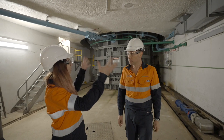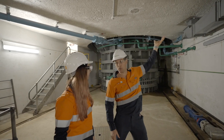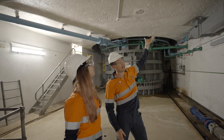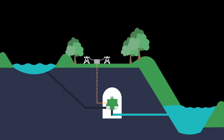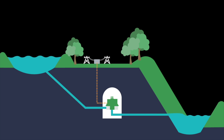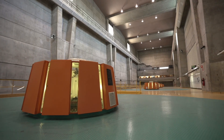So how does the pump work to push water all the way up there? There's an impeller in here which pressurises the water to push it up. To drive that impeller we have the generator up higher. When we're pumping, we draw electricity from the network and drive that generator to push water up the hill — so it's no longer a generator, it's now a motor.